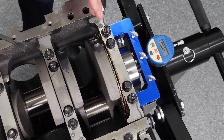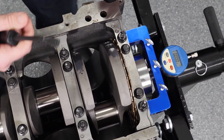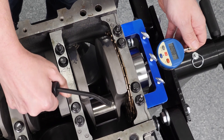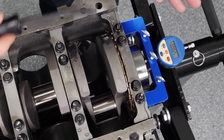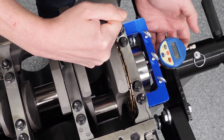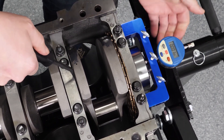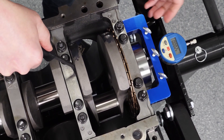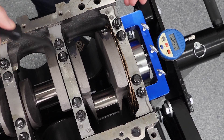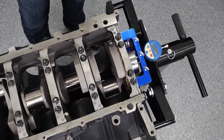You also need to find a place on the crankshaft to pry back and forth to see what that lateral movement is going to be. Go ahead and pull the indicator forward and spin the crank to a place where you're happy. Double check the bolt holes on the back, then pull it back a little bit and zero your indicator. Now pry forward in the opposite direction — you can see we've only got about two thousandths and eight tenths worth of thrust. That's just not enough. We're looking for somewhere between five thousandths to seven thousandths and two tenths.